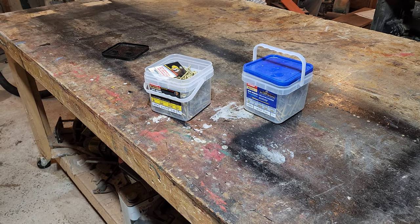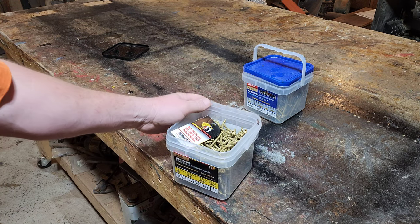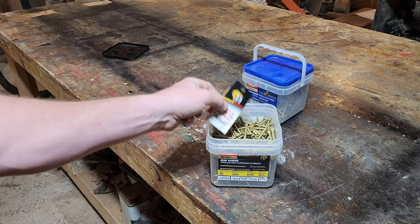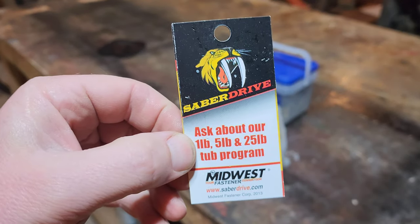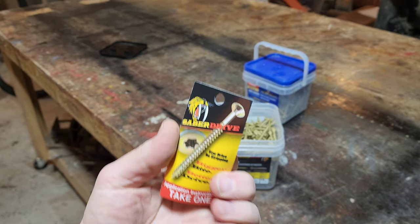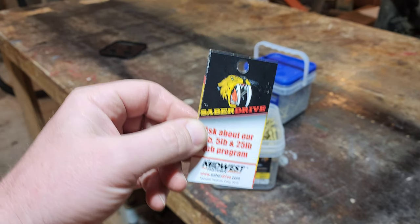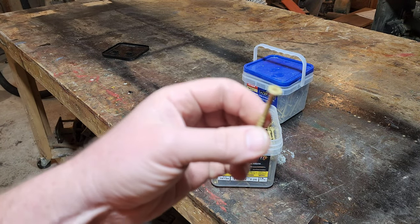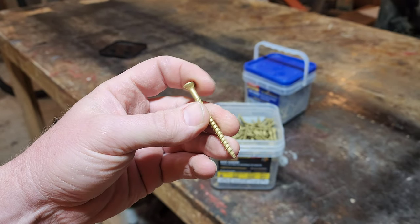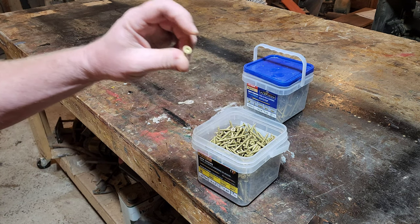All right, let's start off by talking about the kind of fasteners I use for my porch swings. This is a brand common to a lot of the hardware stores around me. They're called, let me pull this pamphlet up, Cedar Drive. Now, I'm not sponsored by anything I'm showing you at all, so in the future, if these guys want to sponsor, that'd be great, but these are what I like to use. They have a weatherproof coating on them, and they are gold in color, which goes with a lot of things. I like that color, and I like the fact they're a star drive.